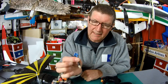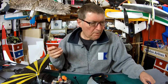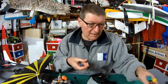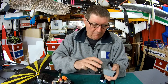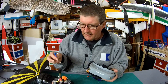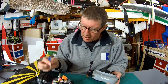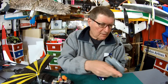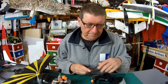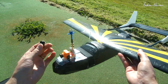I'll compare it to my usual antenna, which is one of these little short Aomway antennas. Last time I did a test at my flying field, I compared all of these different antennas and they all worked perfectly well with hardly any interference — that's because I had my patch on there. So I'm going to take that off and try to reduce the reception power of my goggles. It'd be really good to have an attenuator to test out antennas. So now I can do a direct comparison between the Aomways and the Axies. Let's go out for a fly and see how they work. I'm going to fly around with my normal little short Aomway circularly polarized antenna and then compare it to the little stubby.